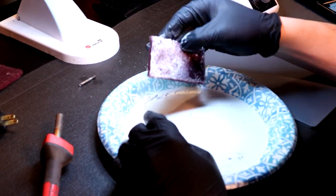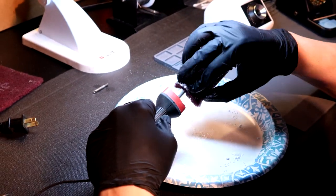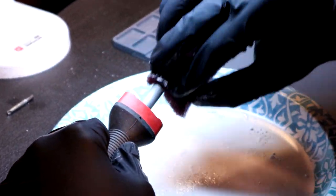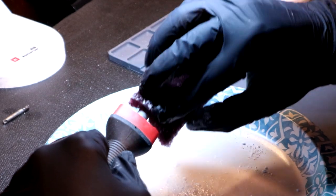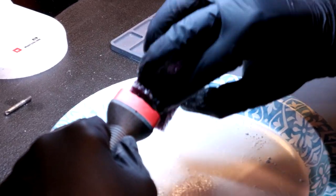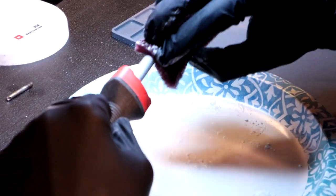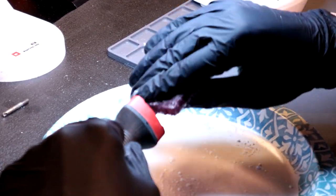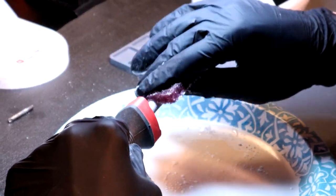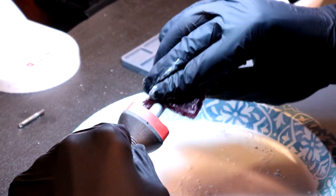Once you have that, with gloves on, we start lightly — and I mean really lightly. Coming over — nothing special, a little elbow grease, kind of boring to watch, but this is it. You'll notice we're starting to get clean. I'm just going in a vertical pattern; I recommend one consistent pattern — that'll help when we do polishing afterwards. Red is the more aggressive Scotch-Brite. I always recommend trying the minimal aggression first and then working up to maximum aggression because the oxidation removal powder is very strong.